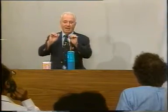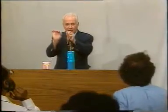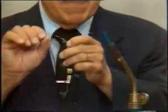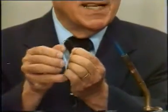This piece of wire — if you could look very closely, you'd find that if I try to bend it, it resists the bending. It has a high modulus of resilience. This is a piece of patented wire, about as tough a wire as we can get. Piano wire has a very high tensile strength. I can actually bend it if I work real hard, but now I'll take this piece of wire and heat it up to a red heat in this flame.